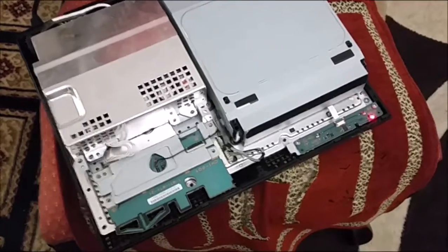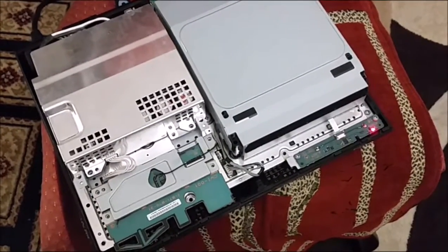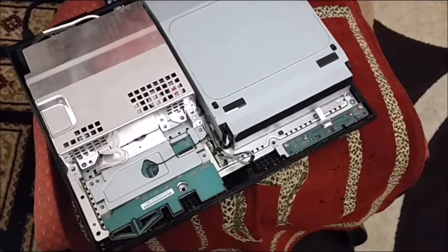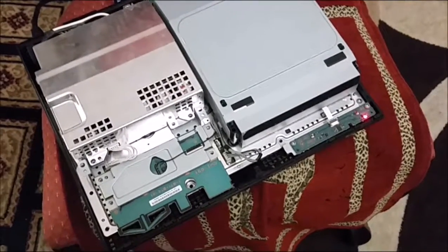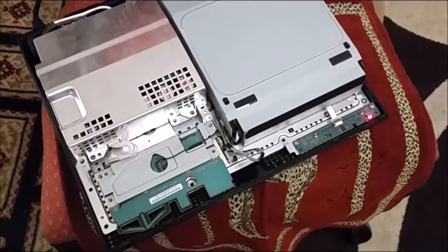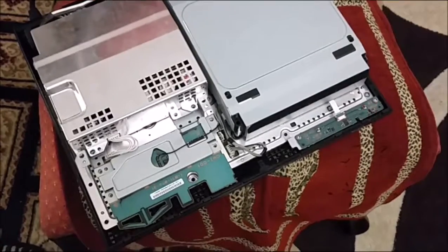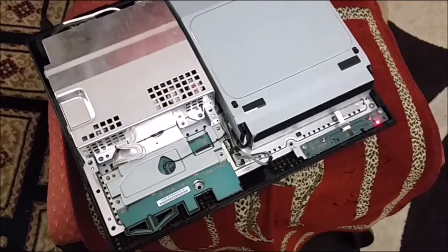I'm going to warn you at the start when it failed, because you don't want to watch a massive video to see it fixed and it doesn't. But we found out what we can do with a heat gun for chips. It does rework from yellow light of death, but trying to fix the chips from the loud fan and the overheating problem, you're going to have to remove the heat sinks, and removing the heat sinks is almost impossible without damaging the chip.